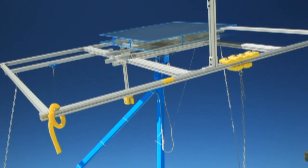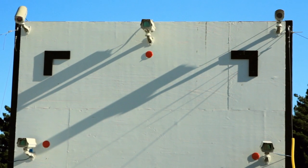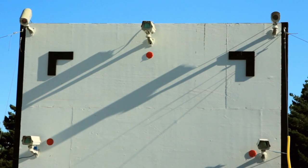The realization that led us to this new method of fine-tracking of a heliostat's reflected sunspot was that we can actually use photometry. What we're talking about is putting cameras around the target looking back at the heliostat field. So, for example, if the ground settles or the frame deforms a little bit, the software will automatically compensate for that change.